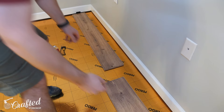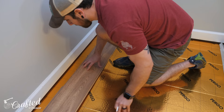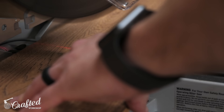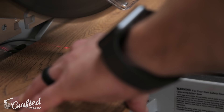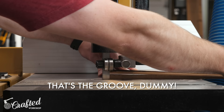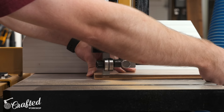For the first row I needed to cut off the tongue on the short edge of the first board as well as rip off the tongue on all the boards in the first row. Before doing that I marked a line on the last board in the first row. I used my miter saw to cut all the boards to length on this project, though a circular saw and speed square would also work just fine. Realistically these cuts don't need to be perfect since they're going to be covered up by quarter round trim anyway. As you might notice, I actually got this backwards — ripping off the groove instead of the tongue — and this caused a ton of frustration when trying to install those first few rows. But once I figured out my error I started over with fresh boards, which made my life a whole lot easier.